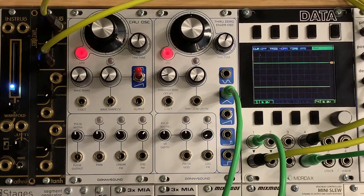So what does it do? Well, it applies a TANH function to the waveform coming in, and it's adjustable. So it's a wave distortion device, but almost more importantly than that, it's a type of compressor. It will both expand and limit the incoming signal, which is nice. If you're going to put it into a feedback loop, it will keep the feedback from running away.